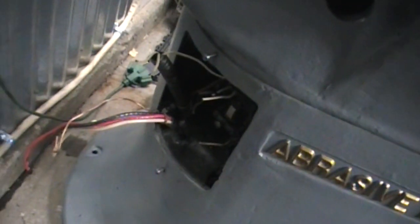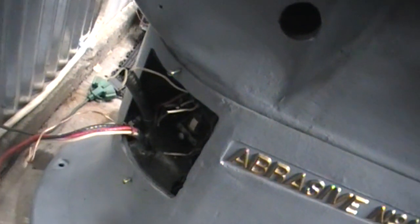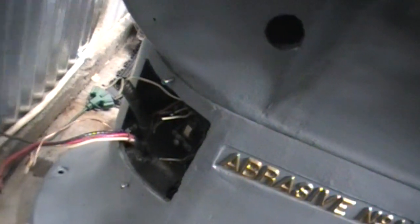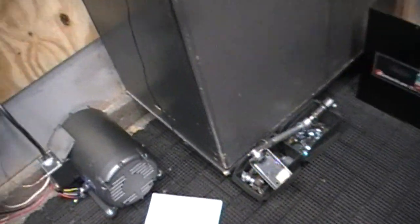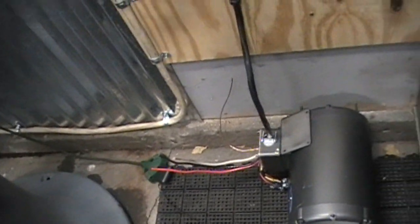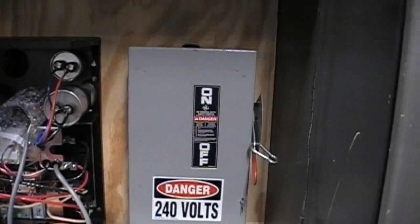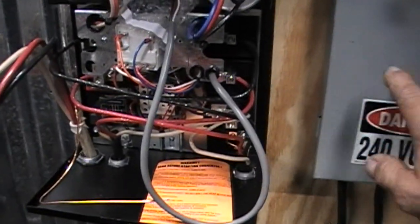I've got the three-phase run into the breaker area on the abrasive one and a half. I've got the motor leads run in there and I've got part of the conduit for the motor switch, which is going to mount on the other side right there and it's still sitting down there in the box. There's my idler for my three-phase. I've got the wires up to it but I don't have them connected yet. I've got my three-phase disconnect and I've got everything wired in for the disconnect.